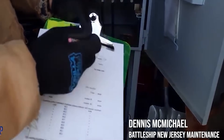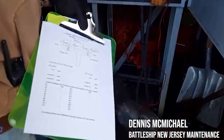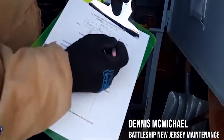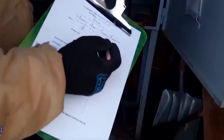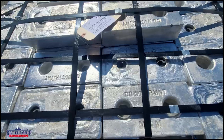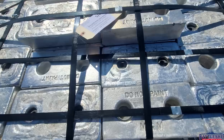Here's where we are right now. These wires — one set goes up from land and brings the power in, but then this goes down and they have wires that go in the riverbed under the ship. The new aluminum anodes came in. More than half of the new aluminum anodes have been installed — all the ones on the starboard side, and they've even started working on the port side now. And we have anodes on the hull. It'll be a brief catch-up.